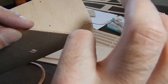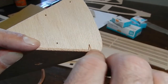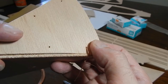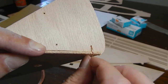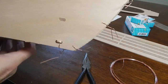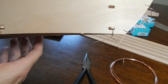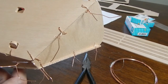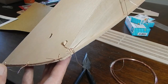Now we're going to use the copper wire to start stitching it together. This is basically just a temporary hold to get the shape and then the glue will keep it, and then you remove the copper. I've got the basics of the boat all stitched together — three stitches up front, three stitches on each end of the back of the boat, and then you stitch across the bottom to kind of cinch it all together.